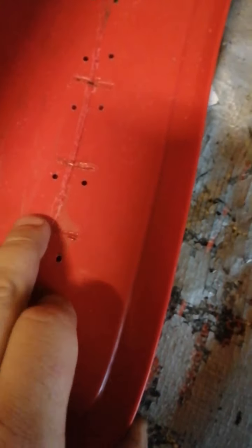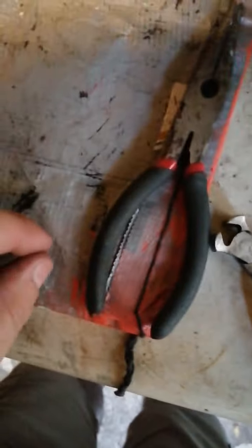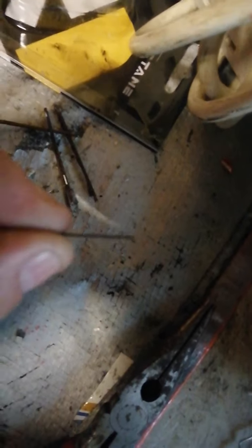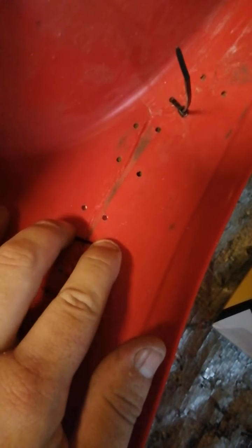You can see I'm stitching it, and what I'm using is just normal hair clips — go into your woman's bedroom and you'll find a couple. The reason I chose them is because they're very thin on one side and flat, with more thickness on the other side, so there's a lot of strength in them. They're just thin enough that you don't go right through the plastic — they melt into it and pull it all together when they cool.